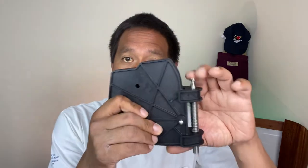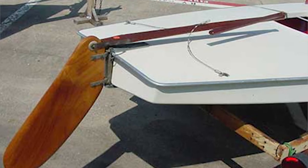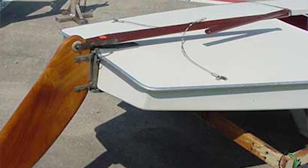Now I want to tell you about the rudders. If you have a new rudder with the pin in the spring, those were introduced in about 1972 and these go into a gudgeon bracket. But the older rudders that have the hinge and a little screw that you tighten them down with and they don't really kick up well — those are earlier than 1972.